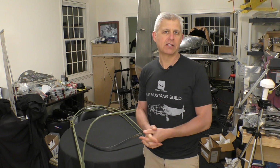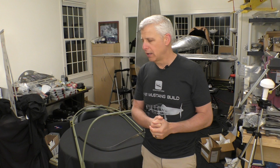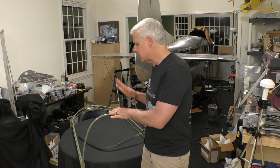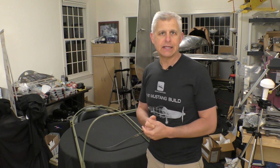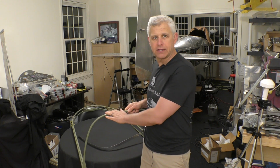The other thing that matters about that is that there are different types of drills that are used for metals versus plexiglass or acrylic. It's a very special drill that doesn't have a split point. It has a very specific point to it with a curve as it comes down. You can get these at a number of suppliers for aircraft tools, and aircraft tool supply is, I think, where we got ours. And as you do that, you create the holes in a way that doesn't cause cracking in the plastic.